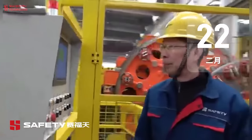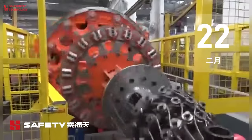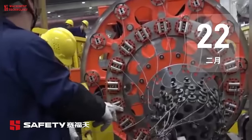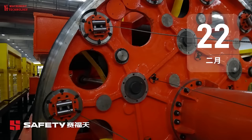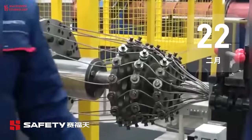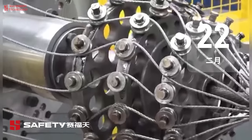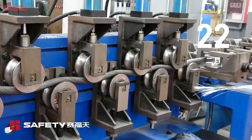Design considerations and customization. When choosing or designing a custom wire rope for your application, suppliers consider factors such as the environment in which the rope will function, required rust resistance, required flexibility, temperature resistance, required breaking strength, and wire rope diameter. To accommodate your needs, manufacturers can do special things like make your rope rotation resistant, color code your rope, or add a corrosion resistant coating.